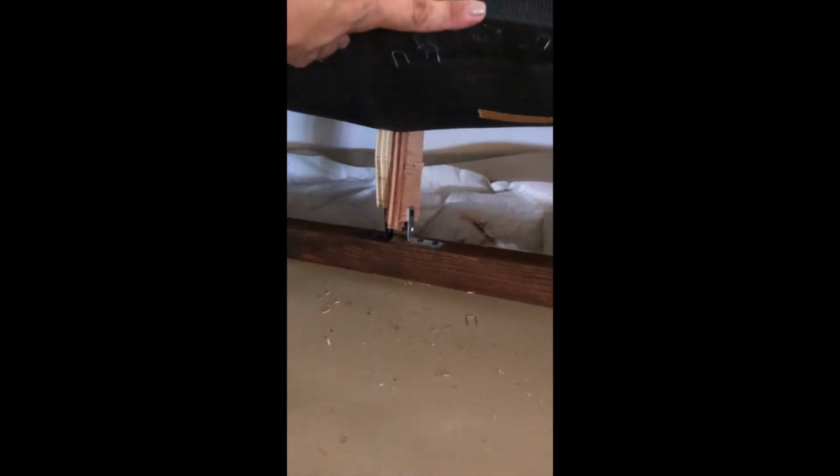Okay, I got a screw into that piece of plywood, which goes up the center of the back, and then those pieces I put L brackets, 2 of those, L bracket over there. So I've got a nice new piece of solid wood across there. Now I will drop this baby down and staple it super tight, and that will give me a nice solid back.